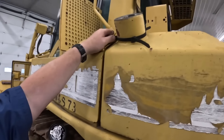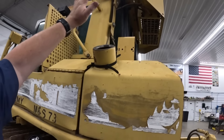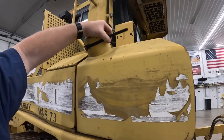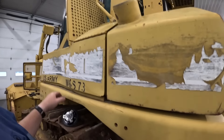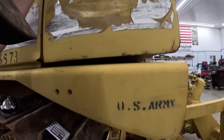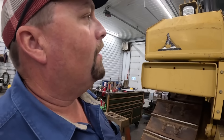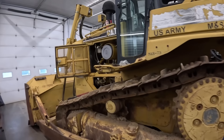You got to keep your eyes peeled in these things. There's a zip tie around here and inside it there's a piece of thin plastic. Somebody probably robbed a fuel cap off this dozer at some point. It probably rained in there and then they put a zip tie with plastic over it — that's disintegrated and let more water in. I'm filling the tank now. There's a brand new looking fuel cap, which tells me this thing's been sitting with the tank open to the elements — completely empty right now with a little rust stain.